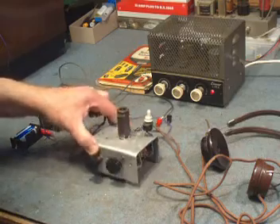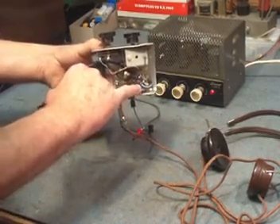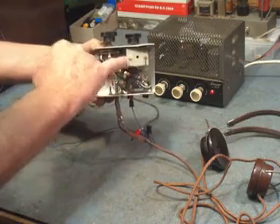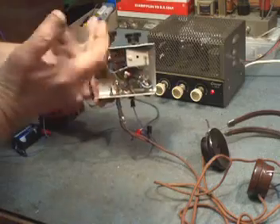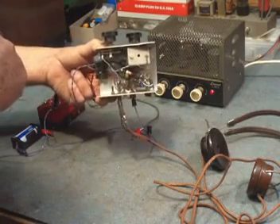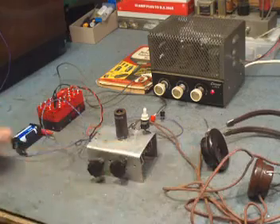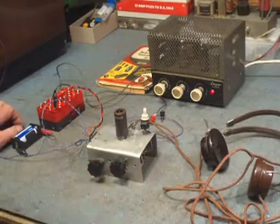It uses a very good quality Repanco coil that was available in the UK from radio shacks and places like that. It's got a tuning capacitor and a reaction capacitor that simply sharpens the valve up and makes it more sensitive and selective to radio signals. At the moment it's quite happily playing through these telephones — they're high impedance telephones, and you have to use those because of the impedance matching to the valve.